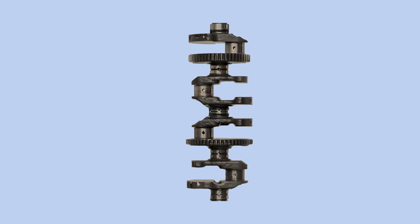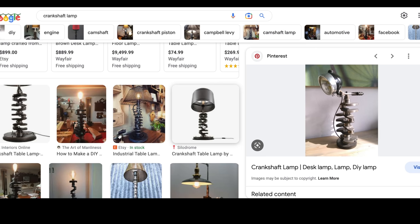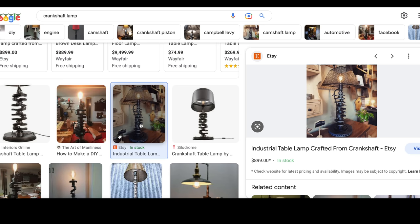That meant I was through here and here, and all I needed to do was drill through this bit and this bit. There were a couple of problems: I can't drill through one side because there's a big gear in the way, and I can't come in the other side because that's where the ball is. Even if I get these drilled through, I'd have to fish a wire making three 45-degree turns inside the crankshaft, and I have no idea how to do that. So we're going to cheat a little — have the wire come in here, run it along the outside of the journal, and back in through this hole the rest of the way. Looking at other crankshaft lamps online, most people just drape the power line down the side, so even my half-assed approach is still better than what most people do.